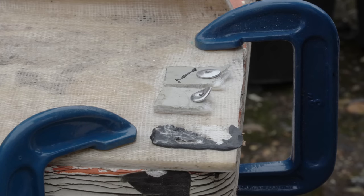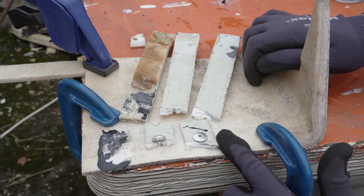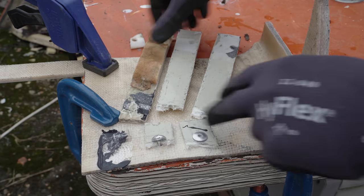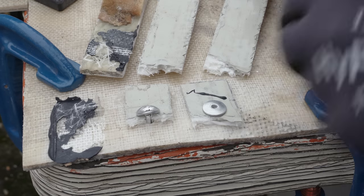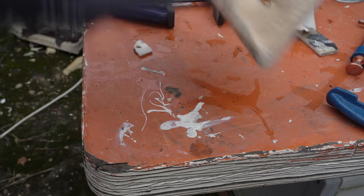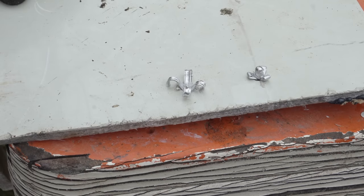This is the second time that I found a caveat to the legend that is 5200. Firstly, it doesn't bond that well to unprepared metal, and this time the peel strength isn't great, although most people are looking for shear strength and use a much greater surface area for bonding. The sealant itself ripped, but also some of it pulled away from the fiberglass, so the mode of failure is mixed. Only the peel rivet held up with any honour in this, I grant you, rather limited and specific test. The blindside parts of the rivets emerged unscathed.